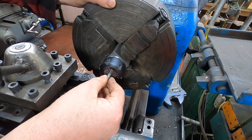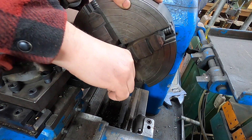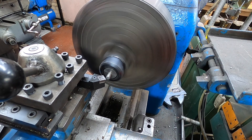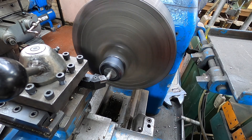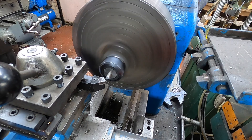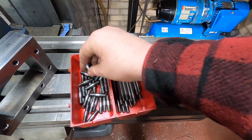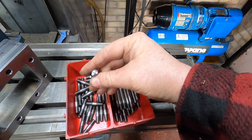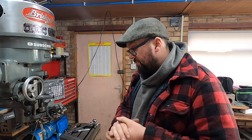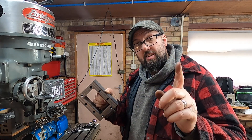Just another 27 times to go. We have those now done. We've got the small ones cut down with the hacksaw, then just chamfered off and deburred. And then we've obviously made the big ones. Before we can put them on the cylinders we've got some extra stuff to do to the valve chests — like we need to put a hole in for where the steam goes in.